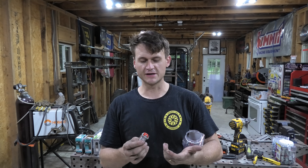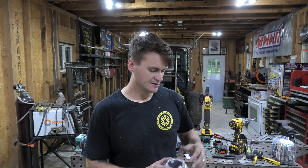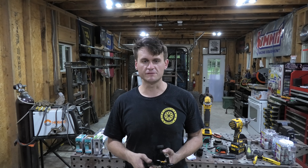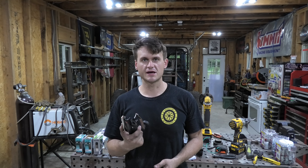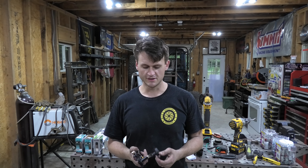These are pretty cool — they make a nice clean install. I just use the grinder with a cutoff wheel to cut the wire to rough length, and then to cut the sheathing off I picked up one of these little Klein tools. These are specifically for cutting armored cable — they're about 30 bucks. They work pretty well. All they do is cut the sheathing, you pull the little metal portion off, and that's how you get the exposed wires you need to wire up your boxes.